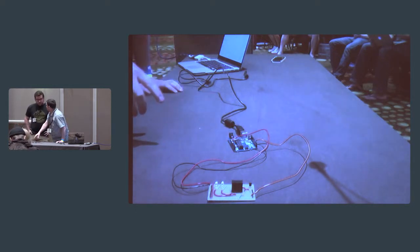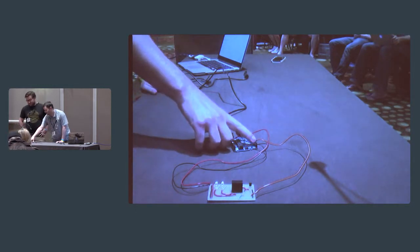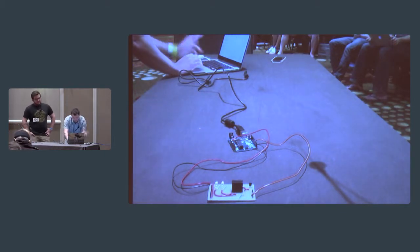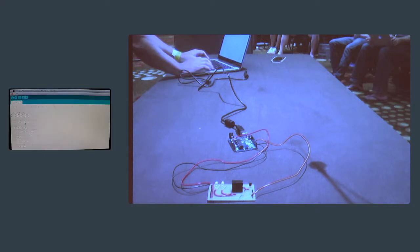Sorry. So we have it connected to an output pin here, and then it'll flip the relay state, which will light up one of the two LEDs, and it'll switch between them. Right now, we start by saying it'll blink between them in 2 seconds, and then what I wanted to do, to show something I find really useful for prototyping, is decrease or increase that delay time between them.